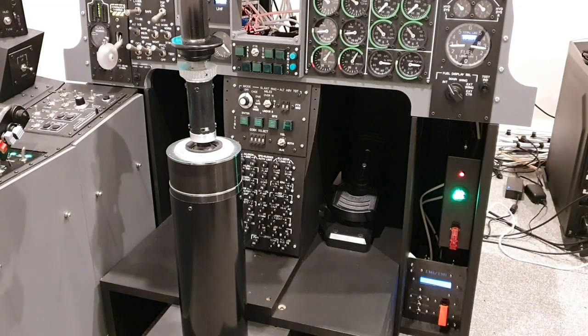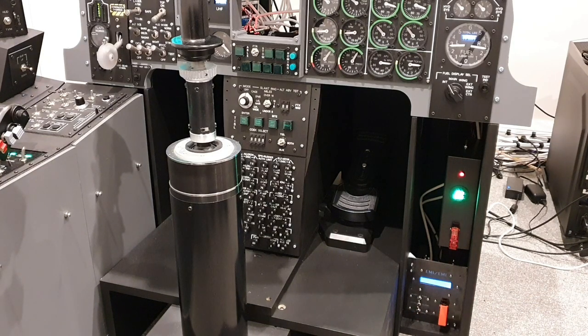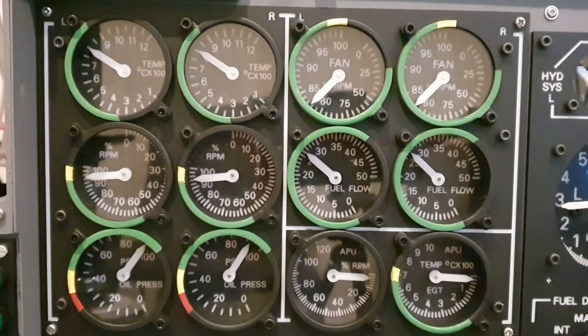Within this monitoring unit I've also put in place three toggle switches, each with a middle position and momentary action each way. I can use those to reset any of the slaves — as I press that one there, the middle toggle pushed to the left, you can see it resets slave number 3 which controls gauges 5 and 6. Toggle another and you can see slave 2's Arduino Nanos are now reset, going through their initialisation sequence. It's handy to have that option if I need to reset any of the slaves or gauges.